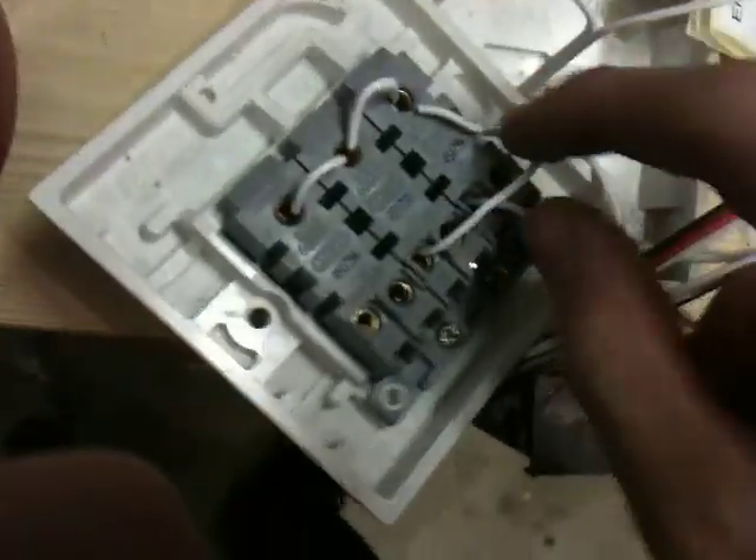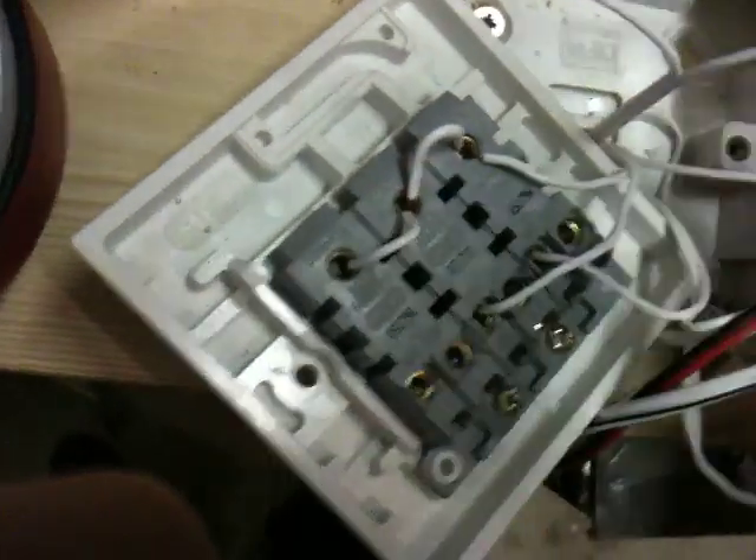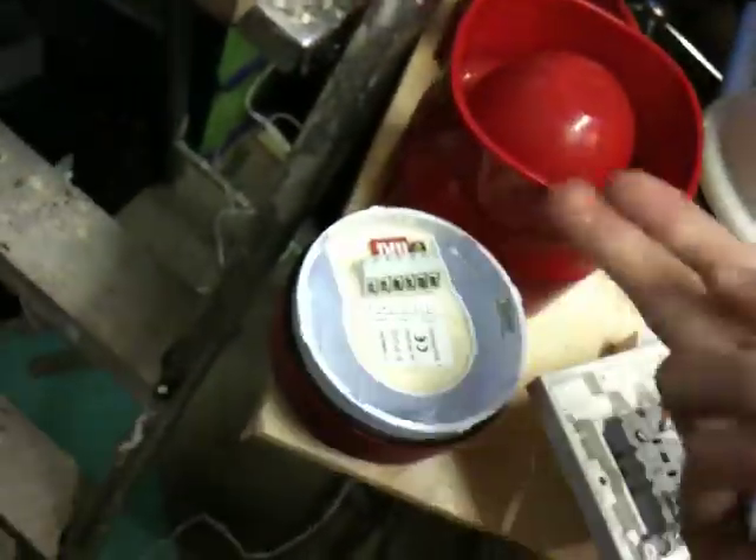With the bell wire you have to wire it up the right way round. As you can see by this little example, the bell wire is all white — when it goes into a sounder it's just white. You have to make sure you get it the right way around. If it doesn't work one way round, just swap the wires around at one end and it'll work fine.